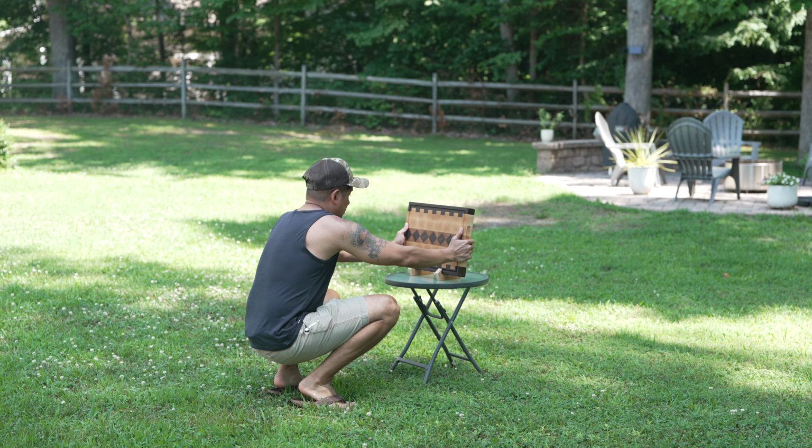I'll be using this 3/8 upcut bit with a 1/2-inch shank from Bits and Bits. I wanted the ability to replicate the stands, that's why I'm using templates and a flush trim bit, just in case my customers want to order the stands with their boards.